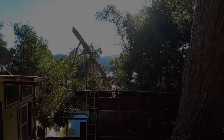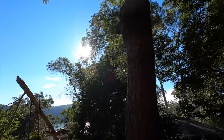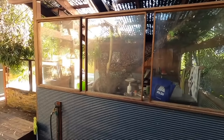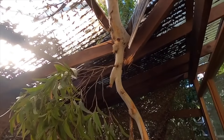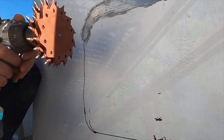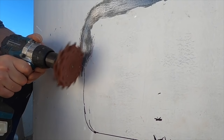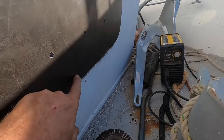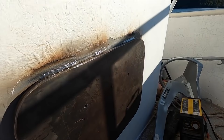Here's today's little disaster. Australian trees, particularly blackbutts, are a shocker for dropping branches. Went through and you only broke one rafter. None of the structures moved. That rafter — you can see the bird's mouth on that rafter's lifted up. A little bit of stick along the top just to hold it in place — that way I can sort of finish it when Paul's not here. I'm going to get a little bottle jack, push the bottle jack against here, bring the bottom in, and then weld it out during the week.